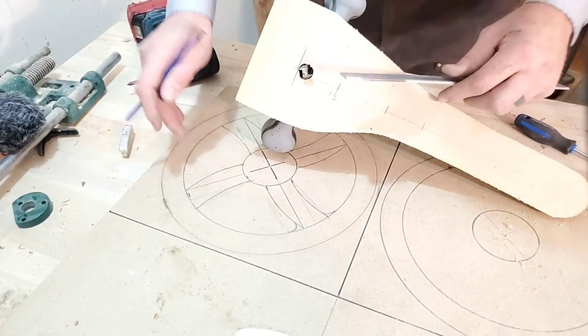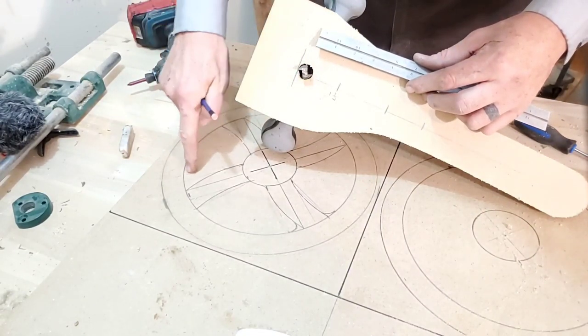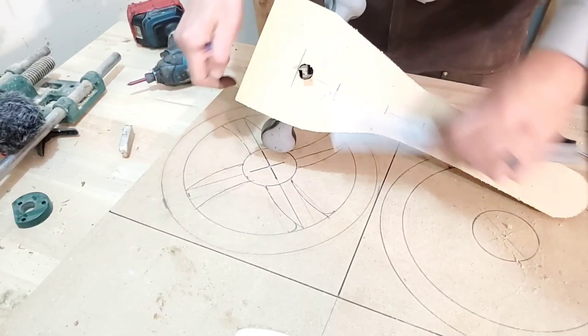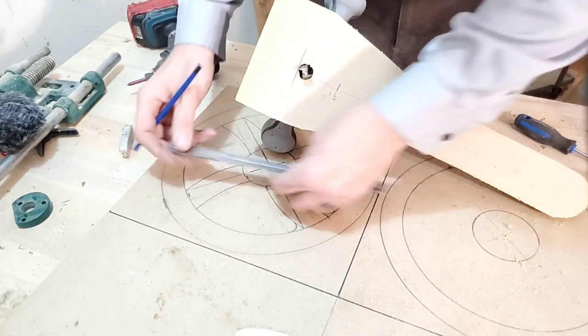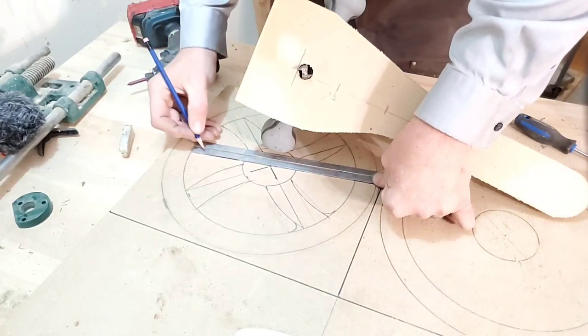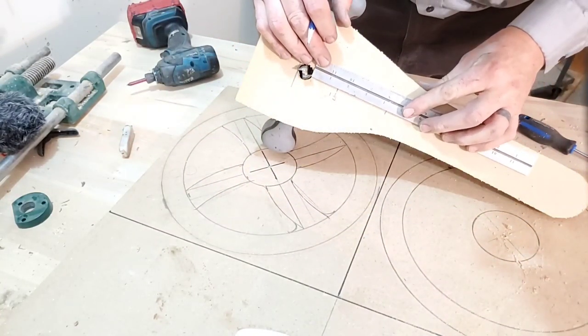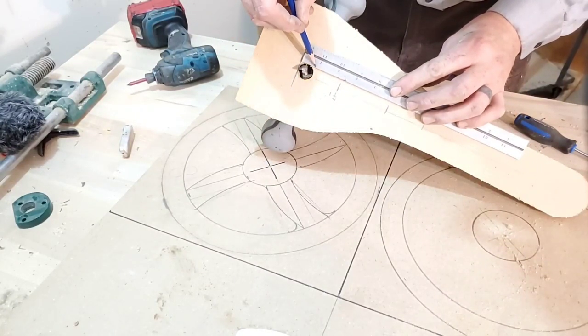The inside is a little bit trickier because we've got to take into account the thickness of the blade, since we're actually cutting on the inside — the opposite side. We're going to be cutting in here. This blade is a three-quarter inch blade. So we're going to measure from the center to the outside — that's just five inches. Then we're going to subtract three quarters from that. You can see that I've already done it — here's your three-quarter inch blade.